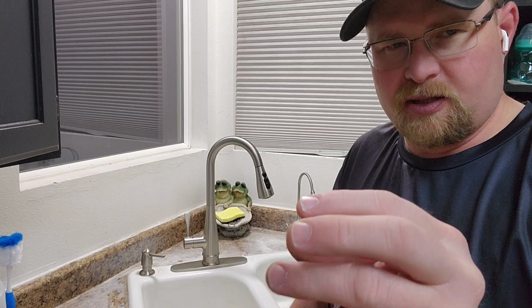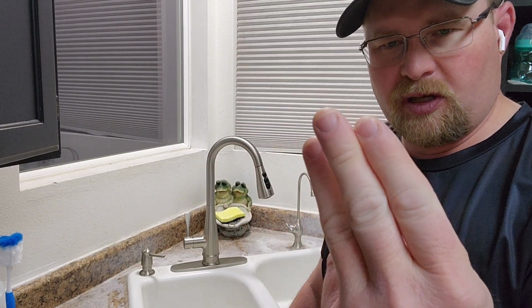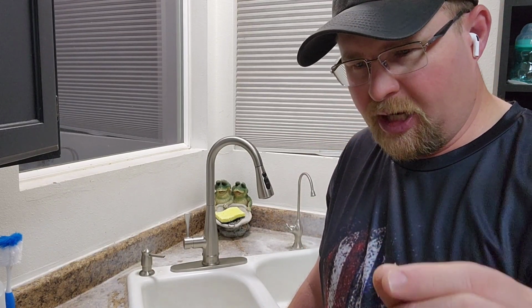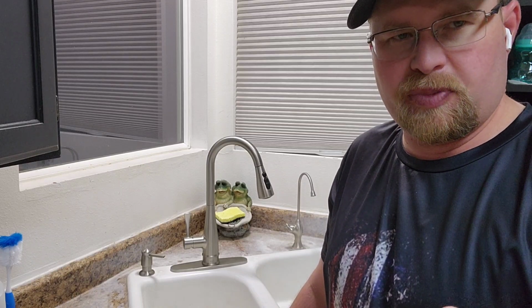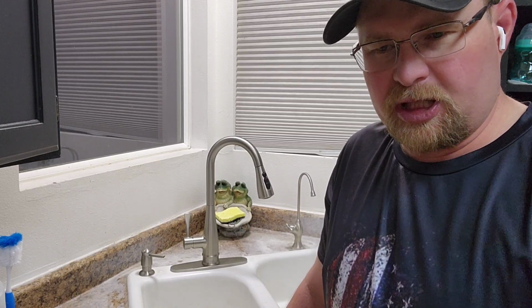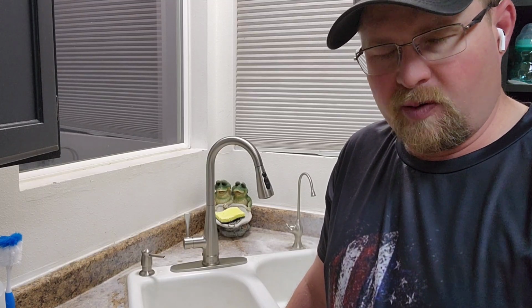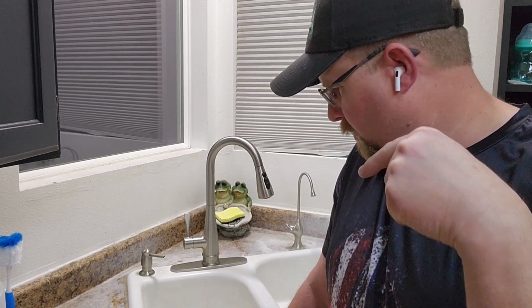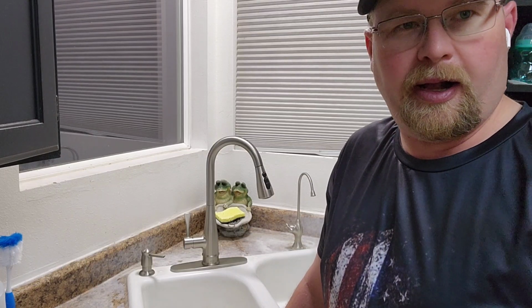That gets you into where all the water mixes inside there. There are three little holes there. I could see right away that the hot was completely plugged with pieces of plastic. So I picked as many of them out as I could, and then I took my air compressor and blew air through that, back out the other side of the hose, and it blew it right out.